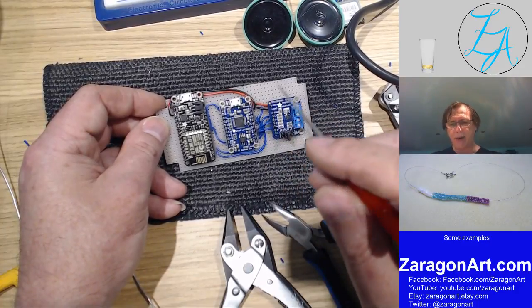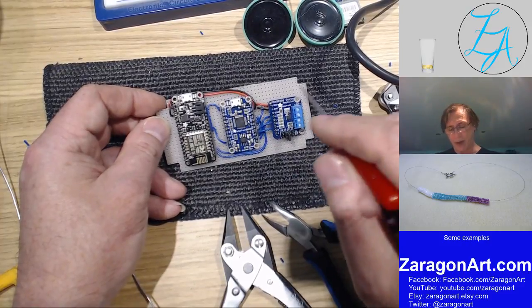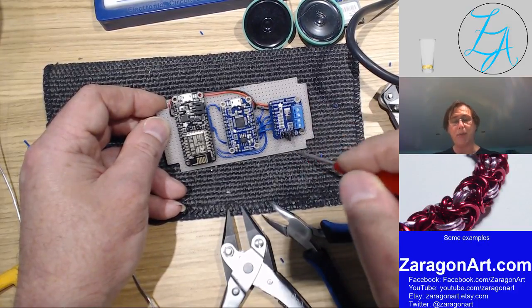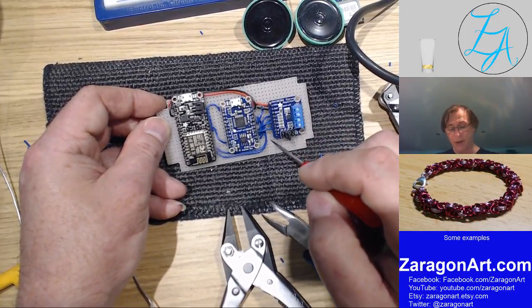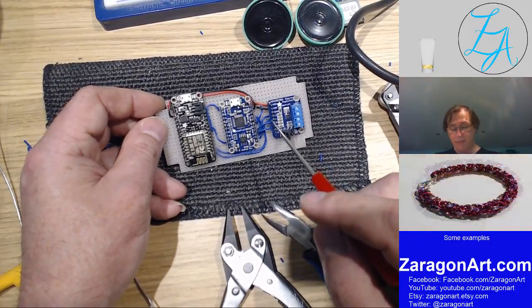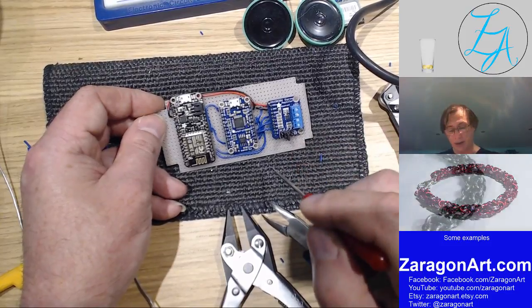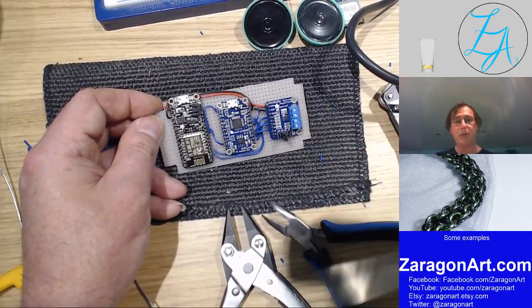This won't play to a normal Bluetooth speaker because it doesn't have Bluetooth. Having said that, although this doesn't have Bluetooth, I could replace this module here with a Bluetooth interface, which would have probably the same 4 connections. And then, yes, you'd be able to play it over a Bluetooth speaker, because the Bluetooth interface would have the same sort of left and right channel speaker connections and power. And so yes, that's how you would build these things.